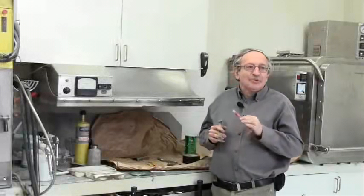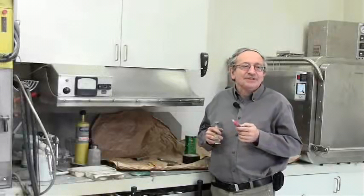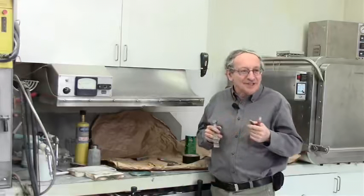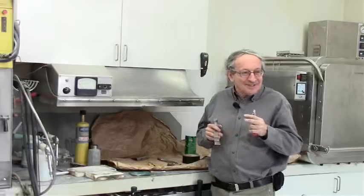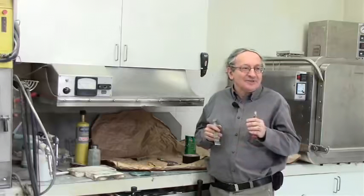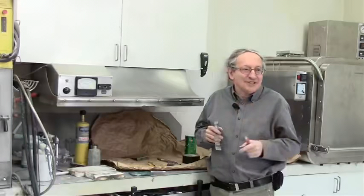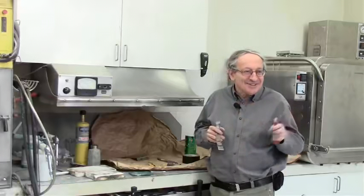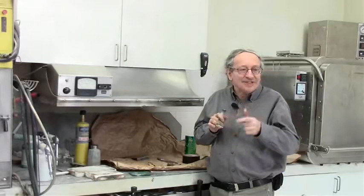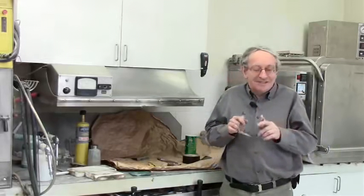Surface energy is a product of the specific surface energy and the surface area. So you can have something with a low specific surface energy but has a highly structured surface, so the total surface area is very large, because what matters is a product. So you can even take Teflon, which is hydrophobic as hell, and you can make it hydrophilic by texturing the surface enough that there is so much surface area that when multiplied by a low specific surface energy still gives a big number. So that's the trick. So the trick is why this retains more is simply because what matters is a product of the area, and this has much more area than this. That's what does it. It's not the mechanical anchoring, it's just the fact that the area is so much bigger.